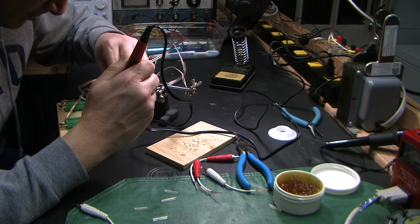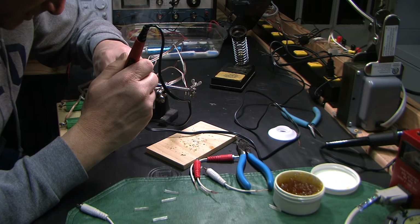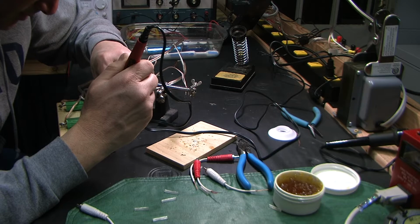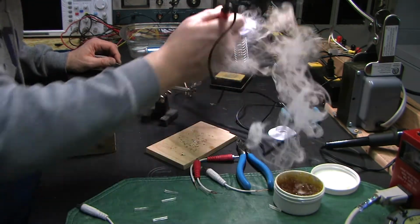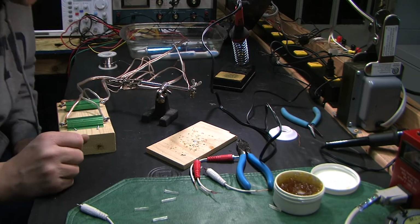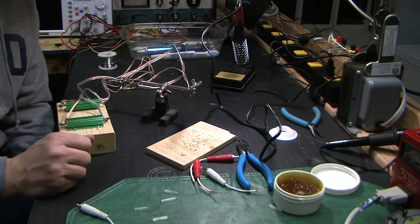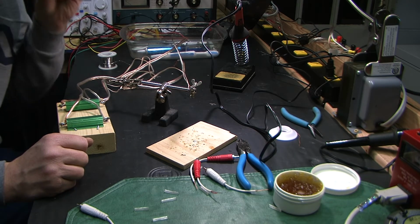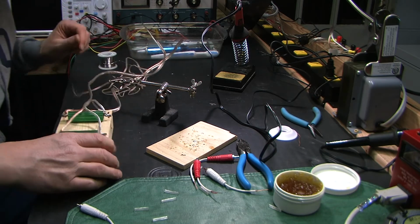And then sometimes there's some protection circuitry in there, and then there's the biasing circuitry, and that's kind of right between all of those complementary output transistors. So, input to a diff amp, into a driver, Class A, into the push-pull output stage, and then there's a feedback. And that's it. And they all look the same, really.